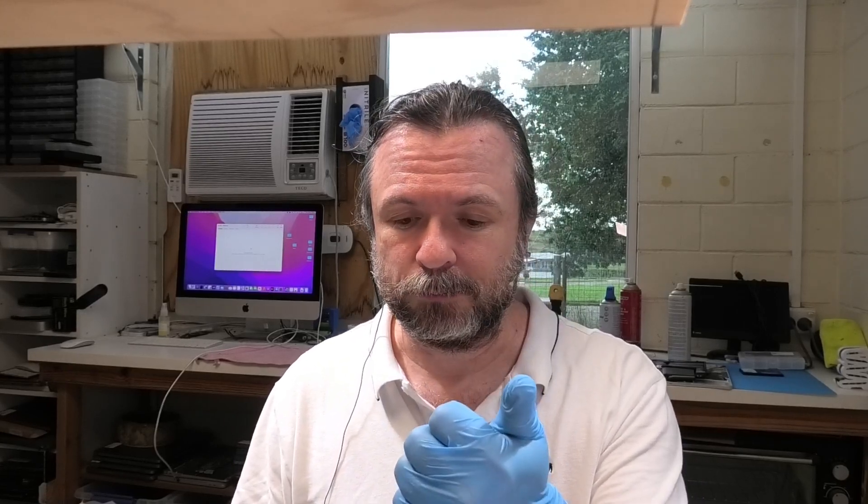Although there are plenty of stories out there about 2141s and 1990s having catastrophic failures, and a lot of them do, there is also a good portion that are entirely repairable. The key points are: make sure you don't power it up before you do anything else. Advise the customer not to power it up. Don't try to DFU or revive it — it's not going to do the job, better to test first. When you do get it, take the cover off, examine the resistances on the important rails for the NANDs. If it's shorted, you know what you're dealing with. Also check PPBus — if it's shorted, that's common as well, particularly on the A1990.